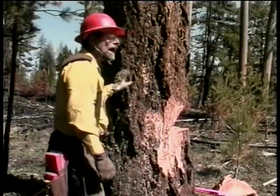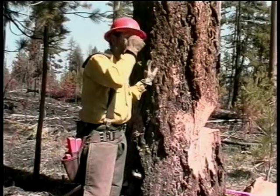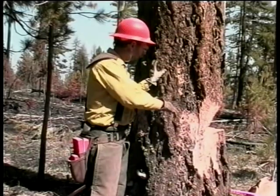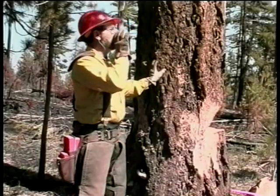Before starting any back cut on a tree, you need to check your felling security again, make sure that nobody's entered the area, and you need to give a good call, let everybody know that a tree's coming down now. Tree falling!